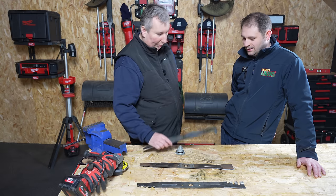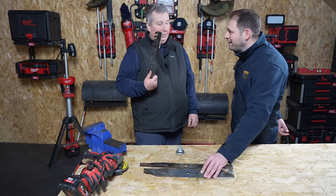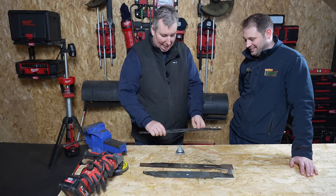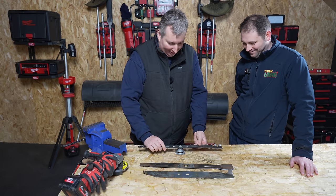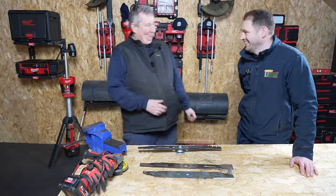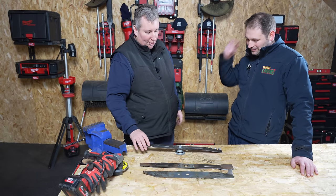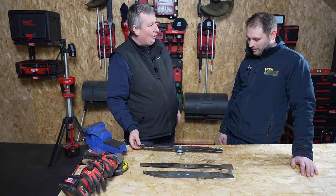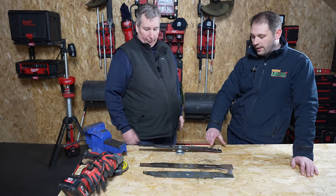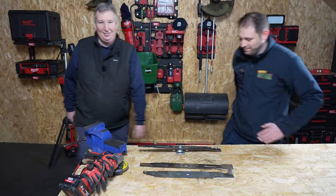So what was this one? That was with the grinder — the moment of truth. Oops — so we're going to say we just took an extra bit off just to show you that it's not balanced. That's one you're going to have to fix. The side that's dropped down the most is obviously heavier, so you need to take a bit more off that side to bring it up level.